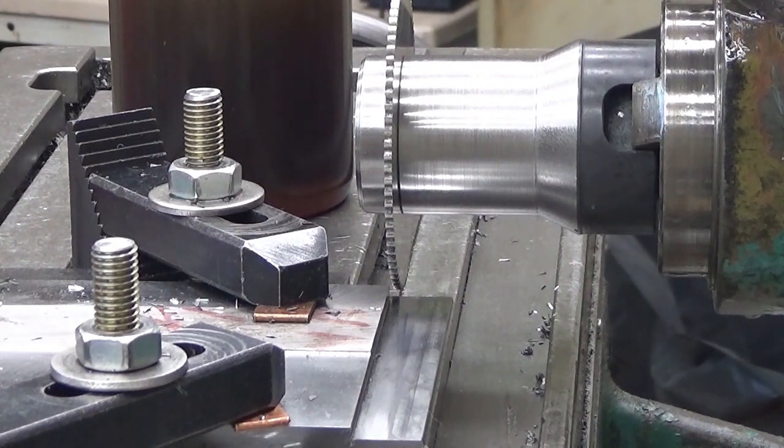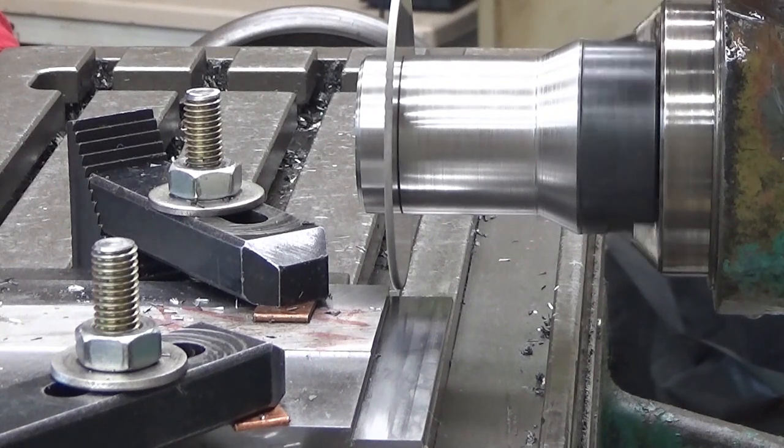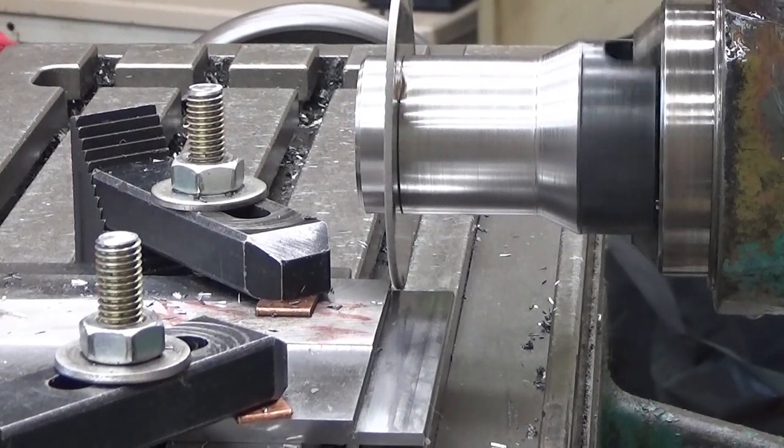Man, hopefully this doesn't spoil my workpiece. Well, it shouldn't, but you never ever know. This time it's a 2 millimeter wide slitting saw, high speed steel, so it doesn't shatter so easily. I'm running this at 100 RPM. And I'm trying to be careful, and I'm using cutting oil. When it now comes out from there, let's see how it sounds.